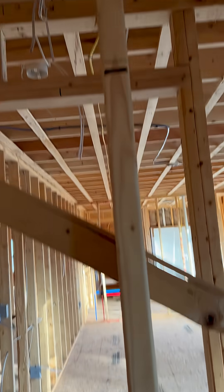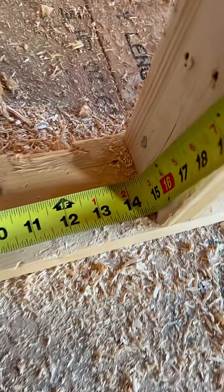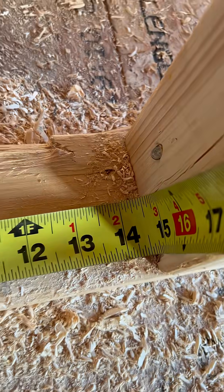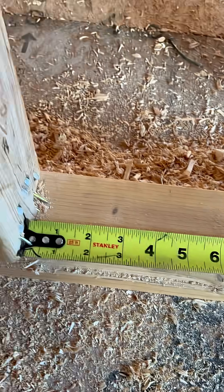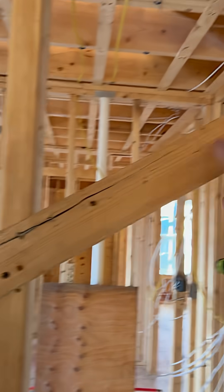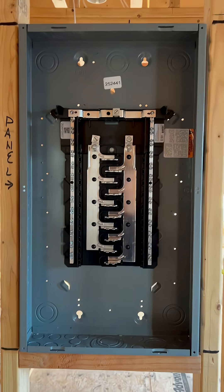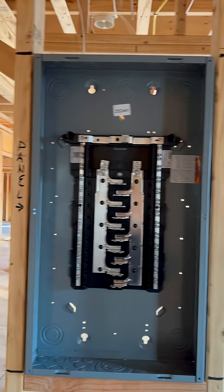I'm going to explain how I like to mount my sub panels so that it gets everything perfectly level and also sits perfectly flush with the drywall. The key step is you've got to measure to the bottom of the studs. If you don't do that and you measure to the center, the measurements are different — the center is going to be bowed, so when you put your panel in there it's going to be way too loose, and when you put your screws in it's going to pull the sides of the panel out and warp them.